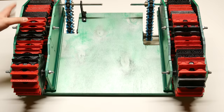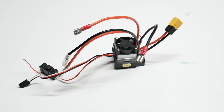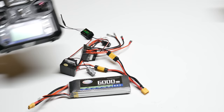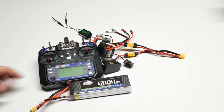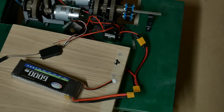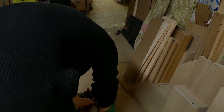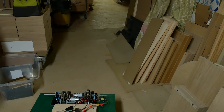The build part is already too long, so let's go really fast with the electronics. I'm using one 3-cell battery and two cheap AliExpress ESCs for brushed motors, and a FlySky receiver and transmitter. But why two ESCs? Because one goes to one motor and the other to the other motor. It's possible to connect one ESC to two motors, but in that case I cannot steer it. How steering works I'll show you a bit later.